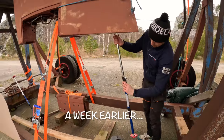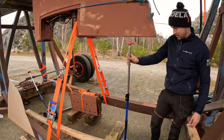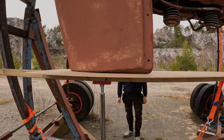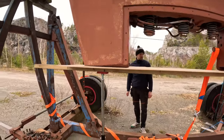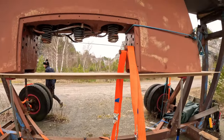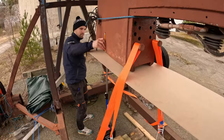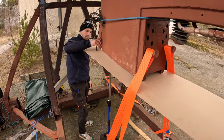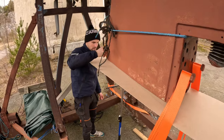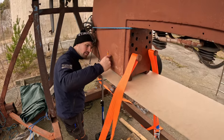So that's what we are going to continue with today. In this video you will see more about the plug making process. Now we are going to do the first step for the plug - we are going to make a template of the keel intersection. We're going to place the piece and draw it in, then cut it out. The reason for doing this template is that we have drawings from when this keel was built - this is just to make sure that all the measurements are correct.